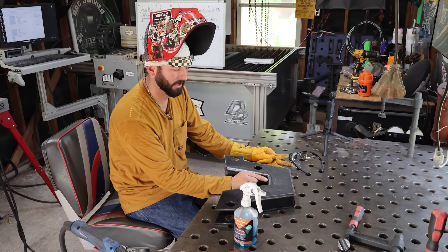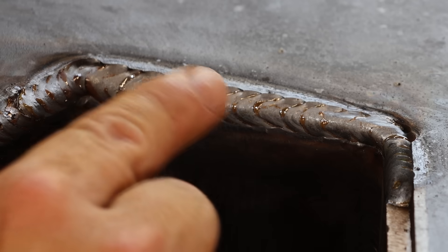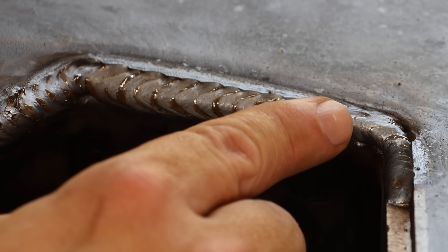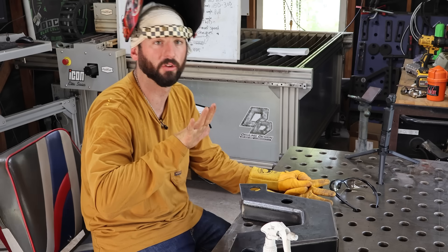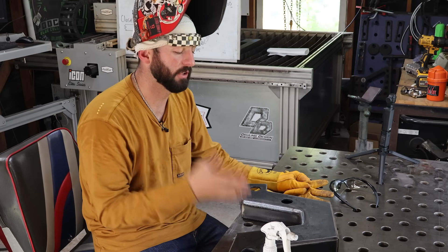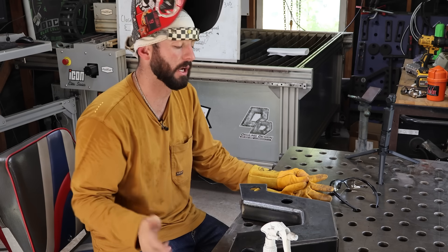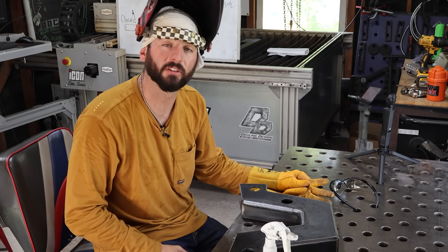As we get to the other end, you can see the undercut disappears because we have less to fill. But then we're packed in to that corner and we probably get a little lack of fusion on that top edge because the weld couldn't wet out to get to that corner. That's why it's so important to have good fit-up. If you want a consistent, clean part with a smooth weld all the way across, you need good, clean, consistent fit-up.